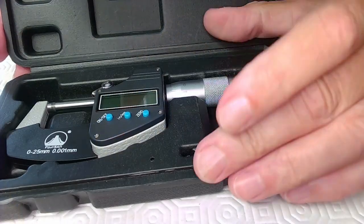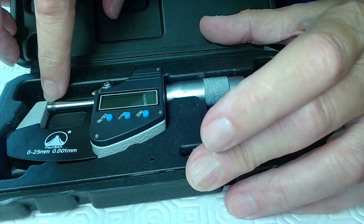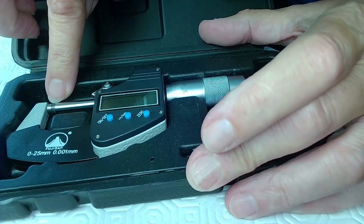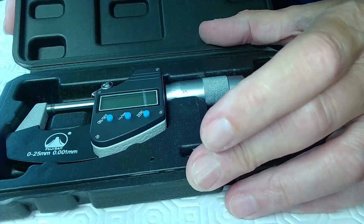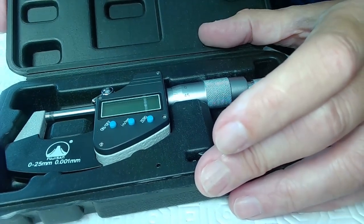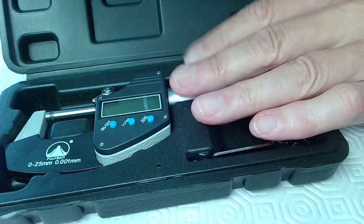My preference for measuring sizes is to get yourself one of these digital analog-and-digital gauges. You really only need to measure the initial width or diameter of the blued steel to start off with, because you're going to use the actual broken balance staff to do the cuts. You may also want to measure the overall length of the balance staff so you have the material ready to cut. In my case it'll be trickier because I've kind of ruined the pivots on the original one, so I'll have to make some guesses on the length and try to measure the distance between the upper and lower balance jewels.